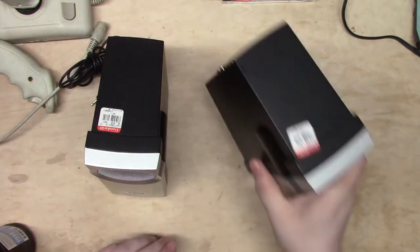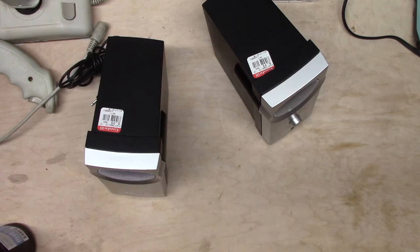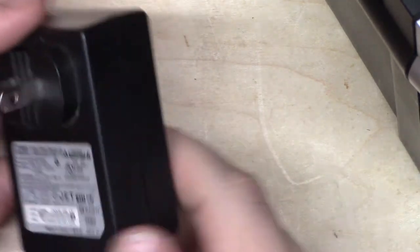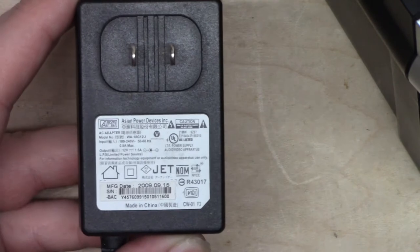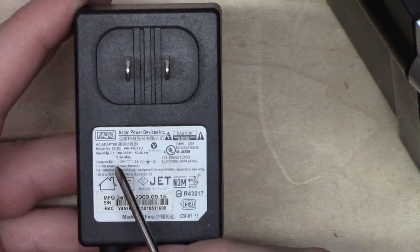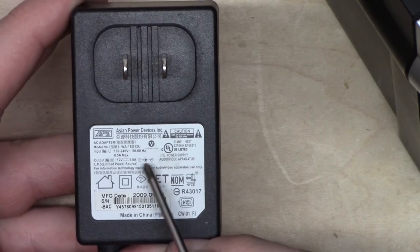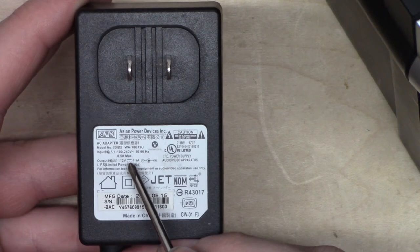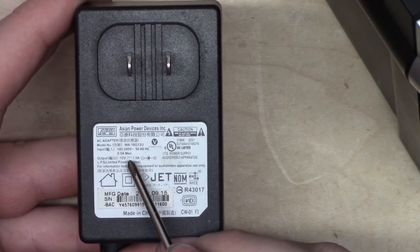Your typical power supply is DC, and there are a few different reasons for that. I'm going to show you an example here, so you'll see what I mean. Here's a power supply I just grabbed off of my power strip. On the back side, we can see the specifications say that it's 12 volts, 1.5 amps. You can read that. Here is the voltage. There's the amperage. Here's the polarity, where it shows center positive. And then this insignia here means that this is a DC power supply. I've never understood that symbol, but that's what it means.